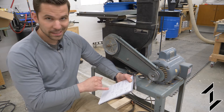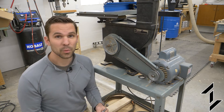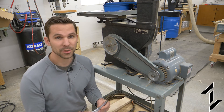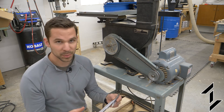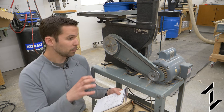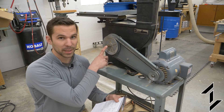I also found a calculator that does that math quickly and easily — also linked below. To get an idea of what different size pulleys were available, I hopped on to McMaster.com, which has a huge range of all different types of pulleys. Using the calculator, I went back and forth to determine what pulleys would be needed with the new motor to get the desired RPM.